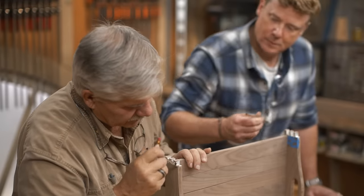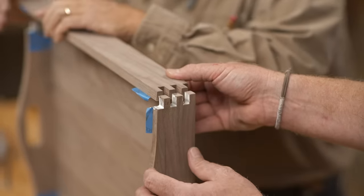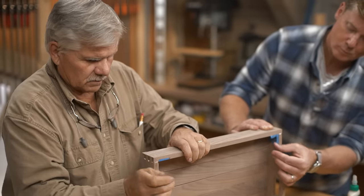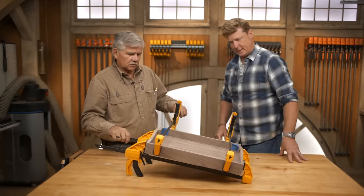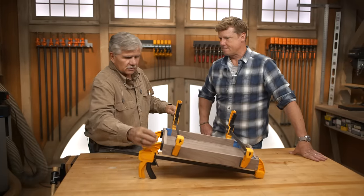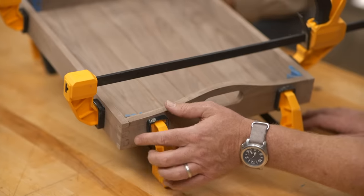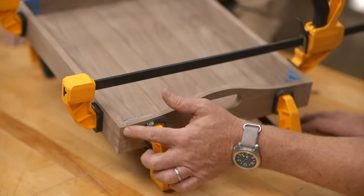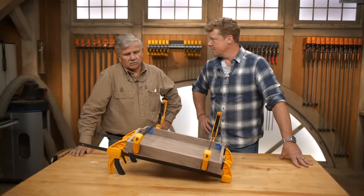I'm tight there. That's good. Look at that, Tommy. I love it. Looks pretty good — I like walnut. It's really nice. So how long for the glue to dry? We should wait a few hours for the glue to set up and dry, and then we can sand all these corners, fine-tune the sanding, and put a finish on it. Love the corners already — yeah, so you can see the joint. Like you said, it's celebrated. Looks good, but you know it's going to hold. And for a finish, something food-safe — I'm thinking maybe a mineral oil with beeswax in it. Buff it up, it's going to look awesome. Nice job, Tommy. I love it.